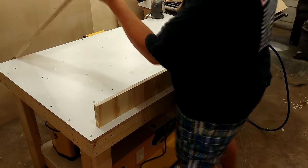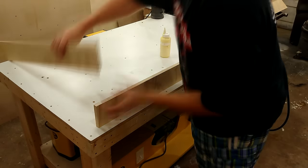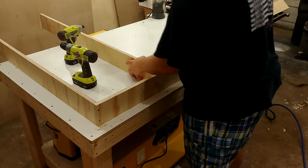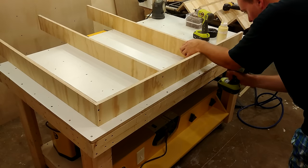To create the upper and lower shelves, I first mark out where the boards need to go and attach them temporarily with glue and brad nails. I then come back with two inch screws, two on each slat.